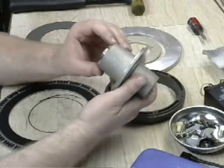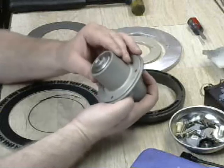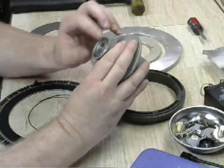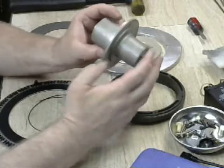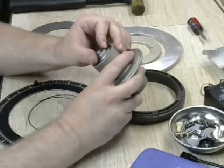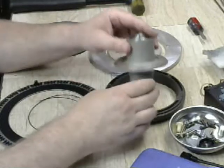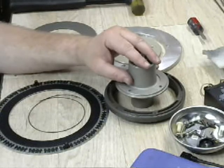And if that one comes out, you probably can drive this one out from the other direction. What is nice is I can read the bearing numbers on here. At least the one. I think I can read that one too. So if I want to replace the bearings, I can probably source them right now and get them ordered and find out what I need. For sure I can read this one. So we'll stop here and we'll continue on after we approach this.